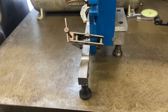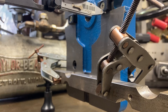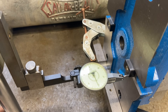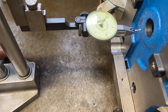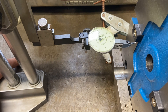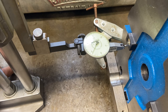The key here is the three-point contact. I'm checking the t-slot tabs — I'm actually on the bottom surface there. I've got it zeroed out and now I'm going over to the other side. Watch how much this is off — it's really a lot. I should be on zero, but look at this: I'm at three to four thousandths right there.